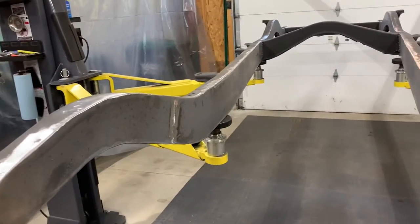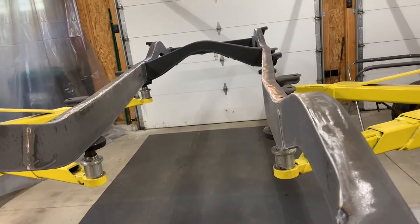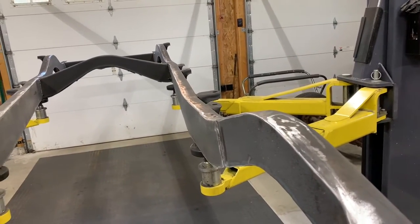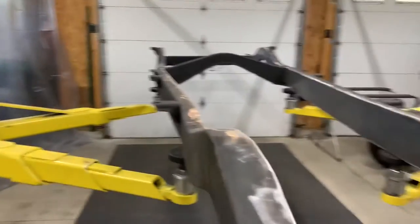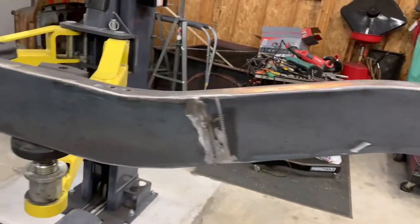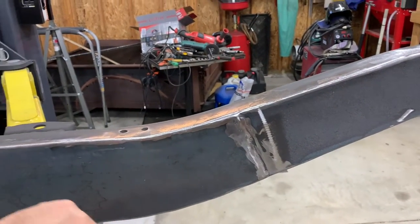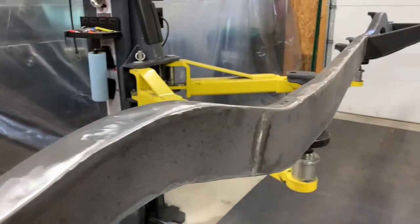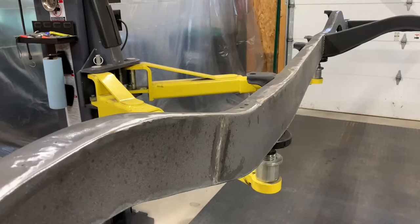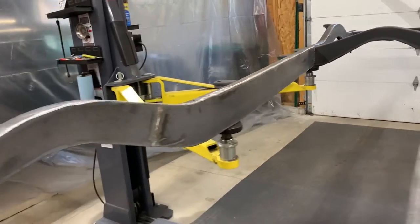What I ended up doing is I got a seven-inch angle grinder and used that. It's kind of a beast but it worked really well. I went through quite a few wheels — actually five — but I could have gone through some more. That way they got those welds down really good. The next step is I'm going to sand this surface with a DA or some sort of angle grinding attachment, maybe 40 grit, 36 grit, or 80 grit — something like that — just to loosen up that surface so it'll accept paint.